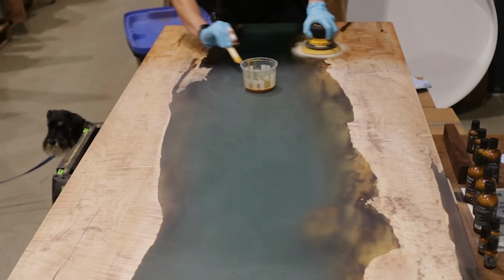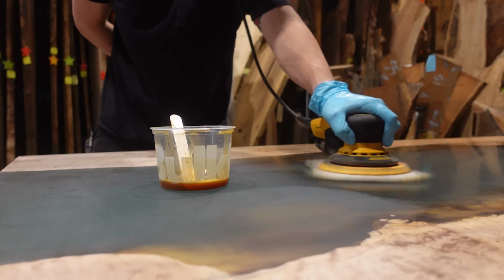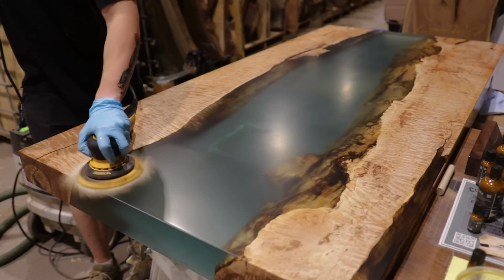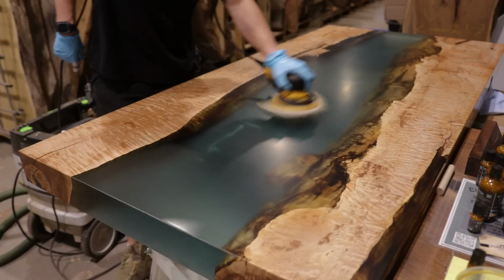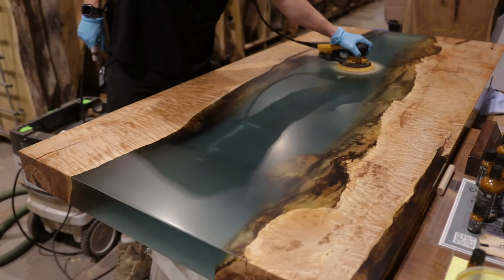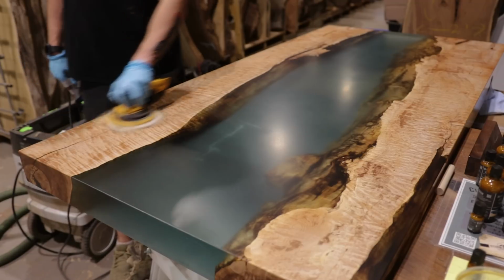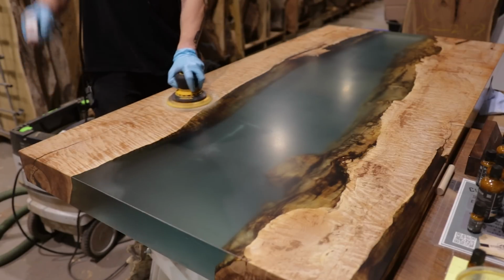Instead of trying to wipe it on, it's almost like you're trying to wipe the oil off. That's the thought you want to have, that you want to leave this surface completely dry, but still something that came in contact with oil at some point. So that's what I try to do. I'm imagining that I'm trying to wipe all the oil off the surface once it gets on. And then I spend another good 15 or 20 minutes afterwards with the clean side of the pad, just evening out any of the imperfections in the finish.